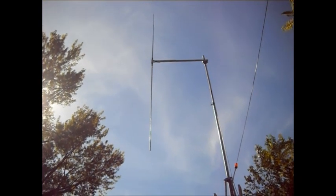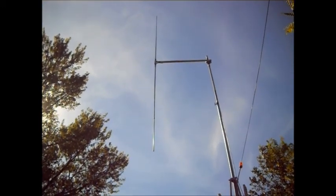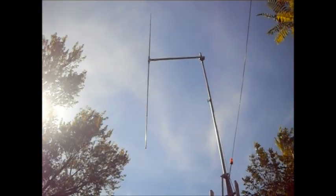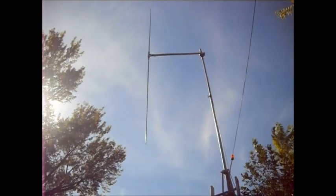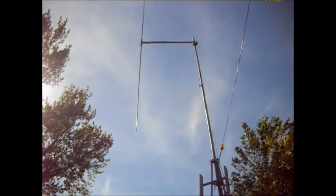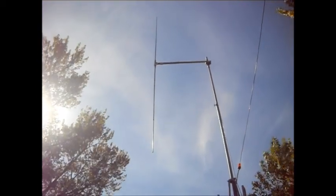But I don't know how anybody else could ever do it, because if you put plastic up there, that ain't going to hold. There's some weight there plus a little wind load. You're not going to hold that with plastic PVC. Maybe if you put some pieces inside of a piece, made a super strong plastic piece of pipe for the top 10 feet, so you know you cleared the bottom element. Maybe I'll experiment and do that someday. I'll see if I can get some pipe to go inside of each other and glue them. Make me a nice heavy-duty one, and then make the dipole maybe a little bit lighter. Use plastic up there? Well, that aluminum don't weigh nothing going across there, so you're not going to gain nothing by using plastic.